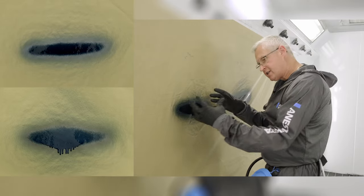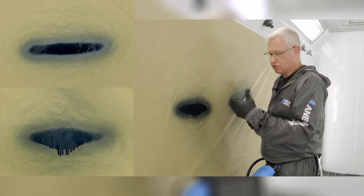As you can see it's starting to sag very much in the middle, which means the material is concentrating in the center of the pattern. This means you have to get your overlaps absolutely right. If you don't get enough overlap you get dryness and inconsistencies; if you overlap too much you get too much wetness, overload, thickness, peel, and possibly boil from baking.